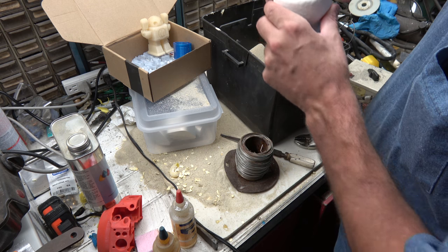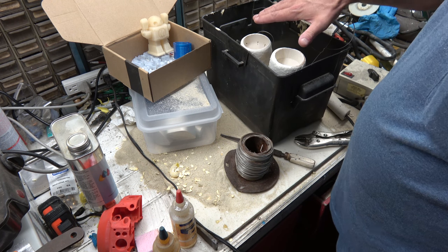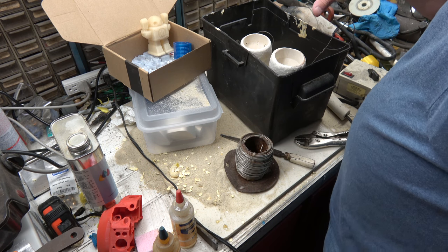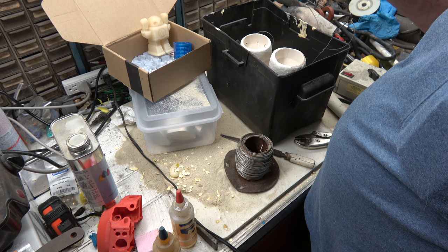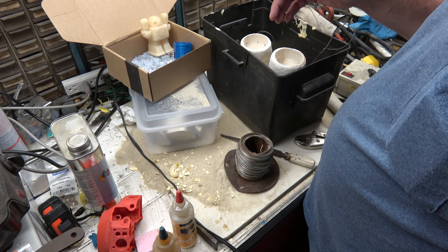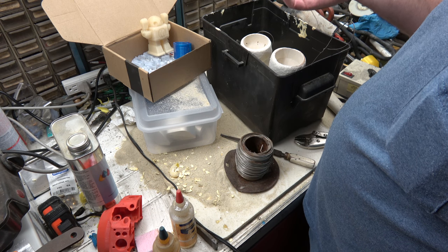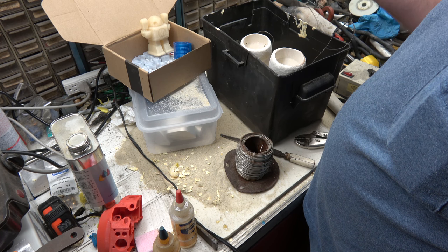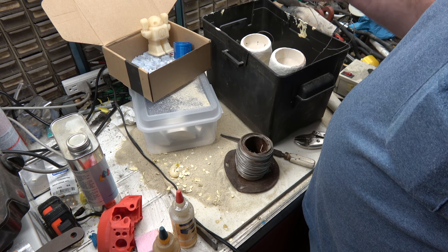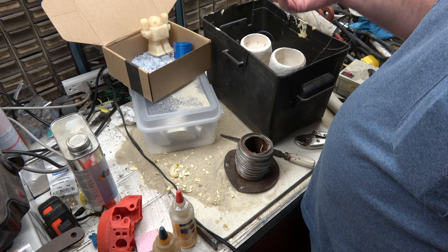Well, I'm going to go ahead and start dragging everything out. I'm going to go ahead and preheat these also this time. The aluminum, I poured it cold, and you get a much better surface finish out of aluminum at either a cold flask or very low temperature flask. If you heat the flask up to, say, 800 to 1000 degrees, the surface finish really suffers with aluminum. Typically if you're pouring aluminum, flask temp is between 300 and 500 degrees.